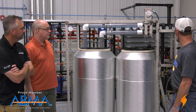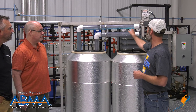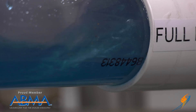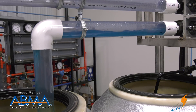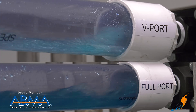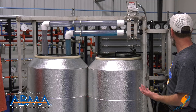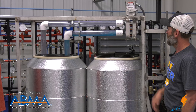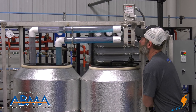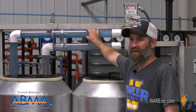I'm going to take this up to 50% — so half open on the V-port. You're going to see a substantial change, but it's still controlled. Then we'll switch to the full port. At 50% range, the full port from 50% to 75% is going to be roughly the same. We still get control with 50% range on the V-port. If I take it to 75%, you'll see a huge difference in the V-port and won't see much of a change through the full port. Not a huge change on the full port, but the V-port is still controlled.